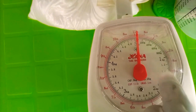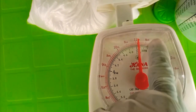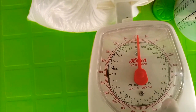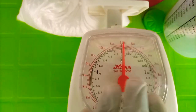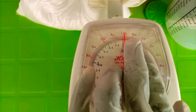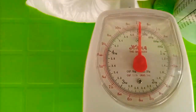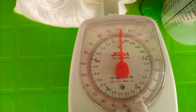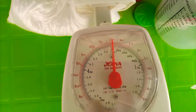For pounds, 'lb' is here — this is one pound, two pounds, three pounds, and so on. If I want to use one pound I rotate from zero to the one-pound mark and start measuring. For ounces, from this point to this point is one ounce, then the next is another ounce. Some scales only have three measurements — that's fine, you just use what you have to do your calculations.